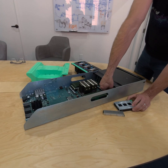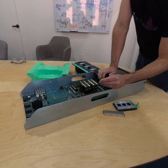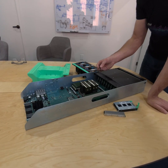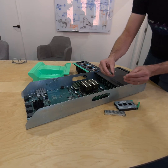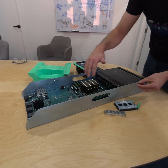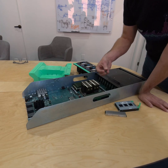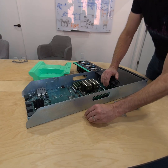We've got these cute little temp sensor boards. We were very mindful of the thermals — probably over-engineered it from a temp sensing perspective — but each of these little boards has a little temp sensor. That allows us to really understand what the temperature is moving through here and understand if we've got any issues. These are designed to isolate the temp sensors from the underlying PCB.